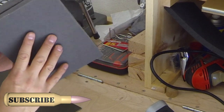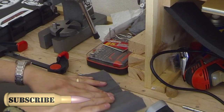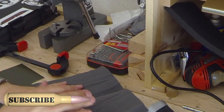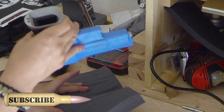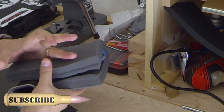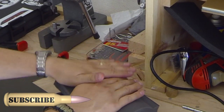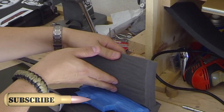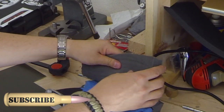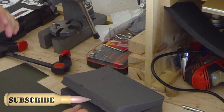Something I decided I'm going to try: I got this two-inch thick piece of foam and I split it. My idea is that when I get the kydex heated up, I'm going to lay this out butterflied open, lay the kydex in it, and then push this down in and allow it to fold up around. Then I'm just going to put this whole thing in the press. I'm probably going to have to put some cotton or material in here so the kydex doesn't stick to this, because this is not high-temp foam — it can't handle the temperature. So we're going to put some cloth in there so we don't have to worry about that.